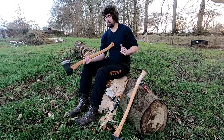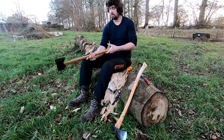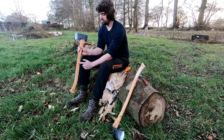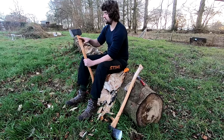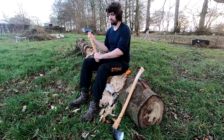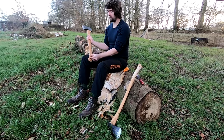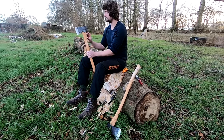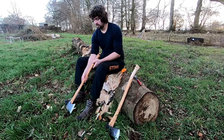How do I do the thinning? I've got various ways. What I start off by doing is aiming to thin down the sides — taking off most of the wood in these portions between here and here. I also focus on thinning up the shoulder a bit, and I leave the palm swell to last. The palm swell can be a bit thicker if you want more comfort, because your left arm — if you're a right-handed axeman — is what controls and aims the axe. This can be thicker; it's basically like a bow in the middle. You want this to be a bit thinner, and you can have a bit thicker up again at the shoulder, but a lot of axes have far too much shoulder to begin with, so you can thin that out a bit more to make it more comfortable.